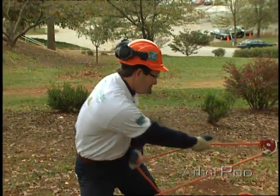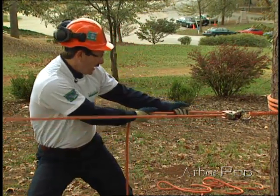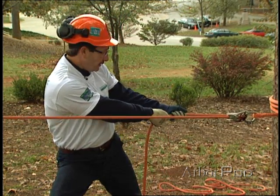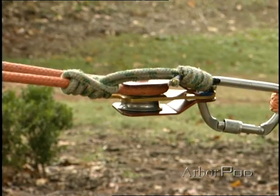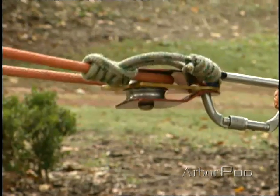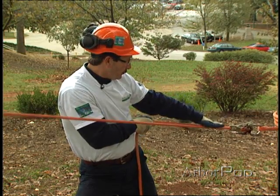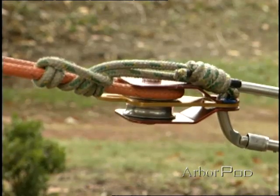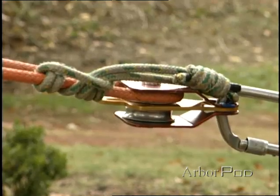When I pull with a 200-pound input force, if we assume there is no friction on the pulley, then we know there will be a 200-pound output force going to the tree. We need to realize that because both parts of the rope are loaded with 200 pounds of force, the anchor force or reaction force will be 400 pounds — a 2 to 1 ratio.